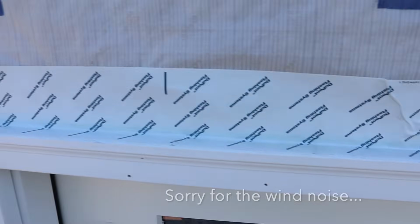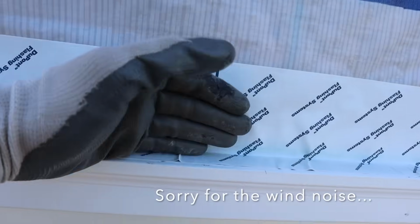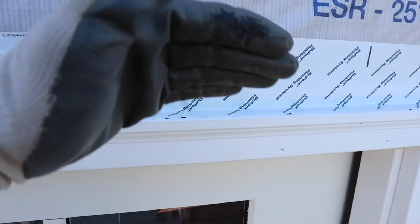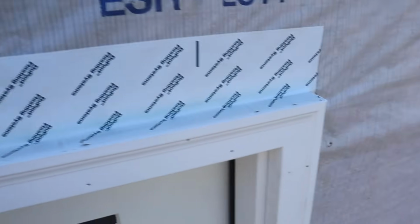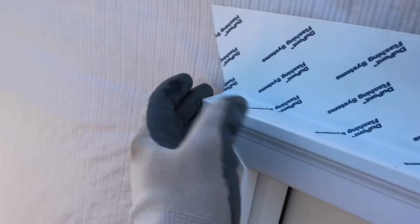So that's what you want on top of your door. If water hits here, it comes here and then over the door instead of behind the door. So I like to do that. Not everybody does this, but I do. And if water drains down these sides, it just goes straight down. So that way it won't get behind the door, but I still take Tyvek tape and put behind here. And that's what the door looks like from the outside.